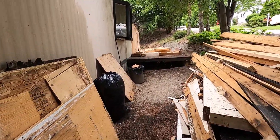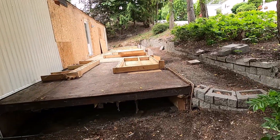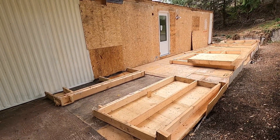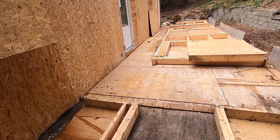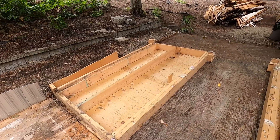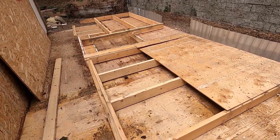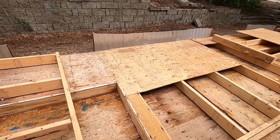I'm a little further along here — took a little bit of a break over the weekend, and yesterday was a rainy day so we finally got some much-needed rain. We're actually in severe drought conditions. This is where I'm at now: the addition walls are all down. The way I've taken this down is I just took my sawzall and sawed the walls up into manageable sections. Now I've got them stacked up here and I'll peel the plywood off of that and just bang it apart.